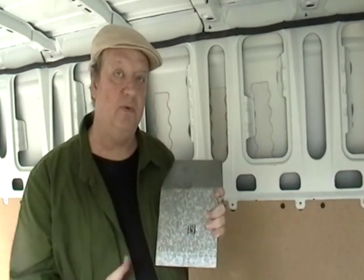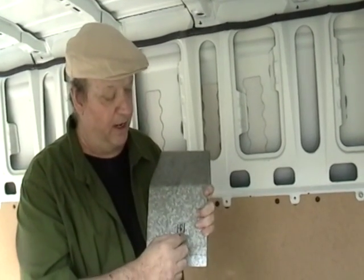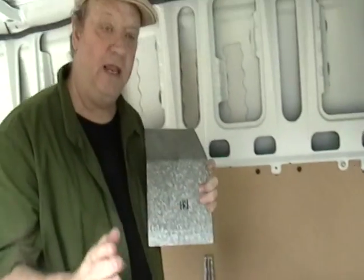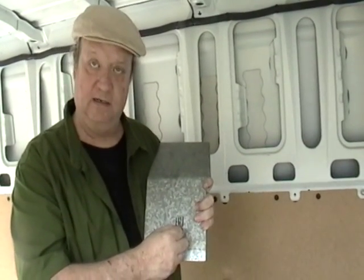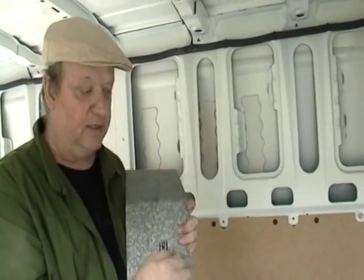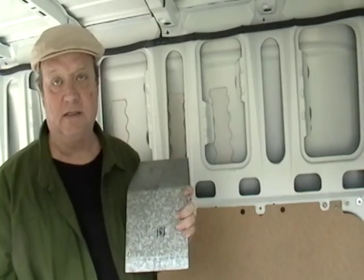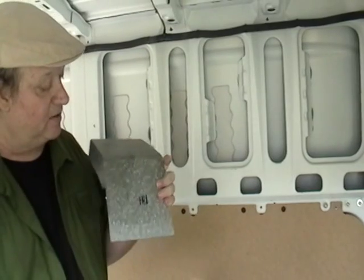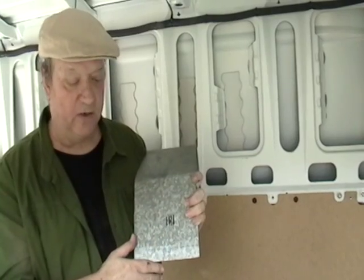Now you can do the same thing with your engine. If you want to know how worn out your engine is, you can make a little chart, mark your stroke of the governor, load the engine at operating condition, and if it moves 75%, then you're using 75% of the horsepower. And so this machine has really turned out to be a very efficient unit, and I'm real happy with the numbers, that it's only using 40% of the engine under operating conditions. And so I thought I would make a little video on how we do this. It's just a way of double checking your horsepower load.